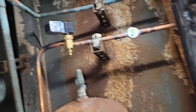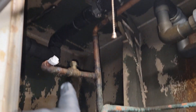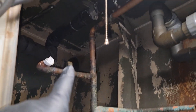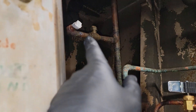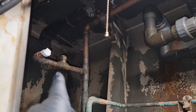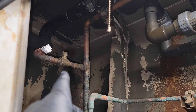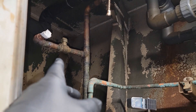My third TXV is coming in tomorrow. Got to do the discharge line hot gas bypass — it dumps right in the suction, 10 seconds on startup. So I guess that's probably to prevent a flooded startup. It only opens up for 10 seconds through this bypass timer.